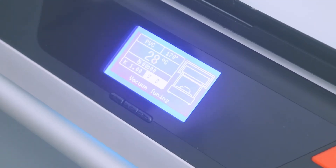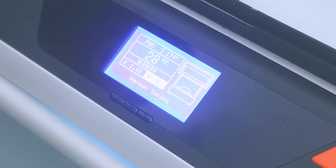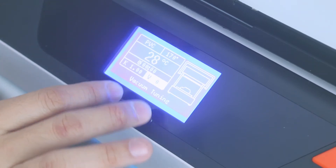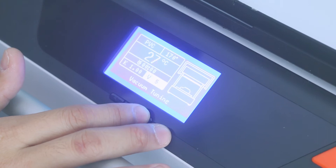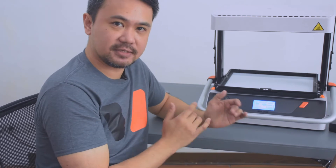When you change the V value, you are changing how quickly the second vacuum switches on. If you want your second vacuum to come on a little later, what you want to do is increase the V value to some positive value — that's between 1 and 7. When you go to 8, that's the maximum positive value. When you reach 8, only the first vacuum will switch on and the second vacuum will not switch on. These are the cases when you only want the first stage vacuum to be engaged.